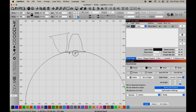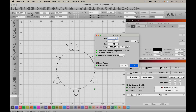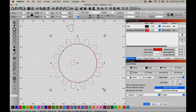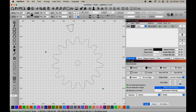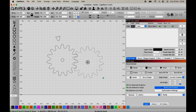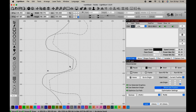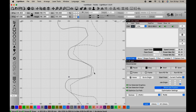The drawback to this technique is that it requires some mathematical calculations around the circumference and how many teeth you can fit within that circle. If you need a different gear ratio, you have to recalculate the circumference to suit the required number of teeth. Once you're happy with the teeth, you merge everything into one layout to create the gear, then replicate it to check it meshes correctly and smooth out any lines that need it.